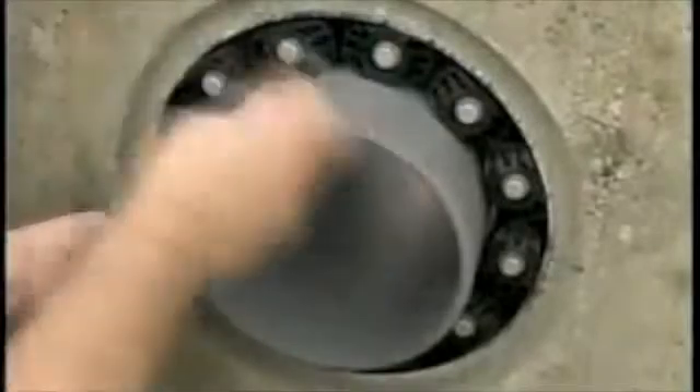Installation is easy. The belt is simply wrapped around the pipe, connected, and secured by tightening the bolt heads moving clockwise around the seal. Pressure plates on each side of the link apply the compression necessary to expand the rubber. As the bolts are tightened, the links enlarge from a free to an expanded state, transforming the belt of separate links into a hydrostatic seal capable of holding in excess of 20 PSIG with a safety factor of 5 to 1.